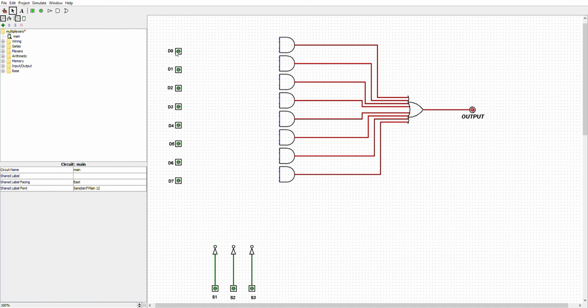So we have these pins here that are going to serve as our inputs. We have the select bits. Okay, we have them connected to the NOT gate, because in some cases we will need this particular pin to output 1. In some other cases we will need it to output 0. Okay, so that's why we have the NOT gate to help us with that. We have it here. We have our AND gates. We have it connected to a NOT gate and then the output right here. So now let's go ahead and then connect the lines to the inputs.